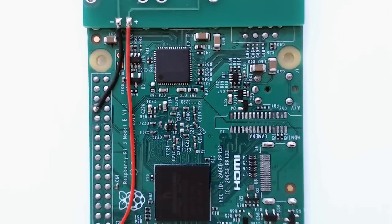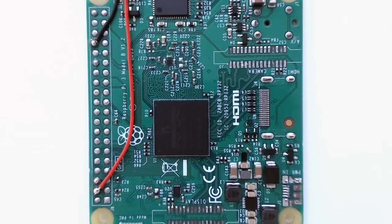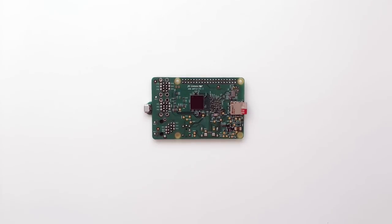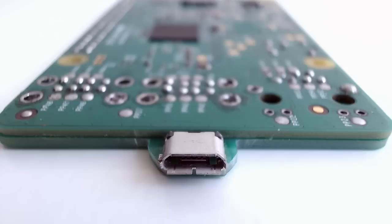I used an upside down micro USB component, allowing the power port and micro SD card slots to be on the same side, which also saved space in the process. I removed the extra USB ports on this version because I was having problems getting it working consistently, and also because if you're running a headless server there's probably less chance of needing to plug external peripherals in anyway.